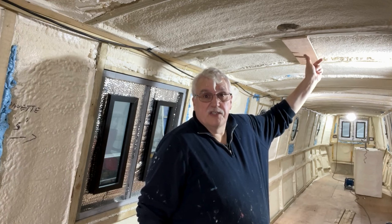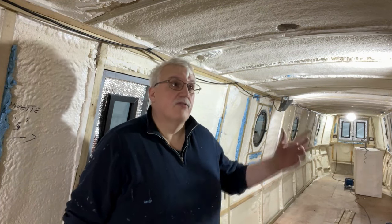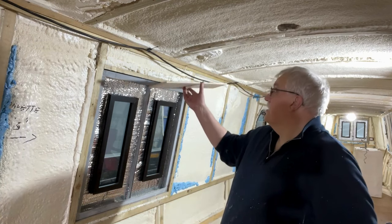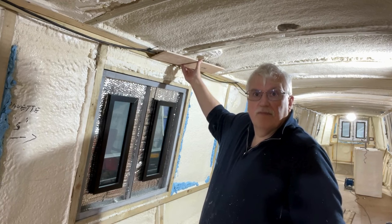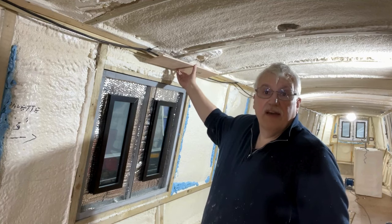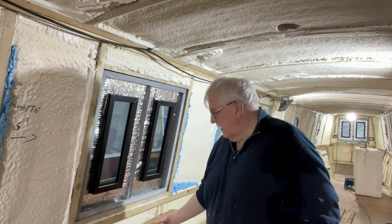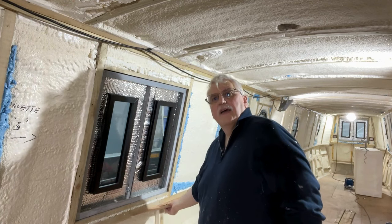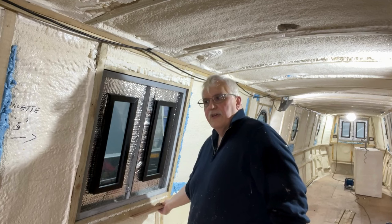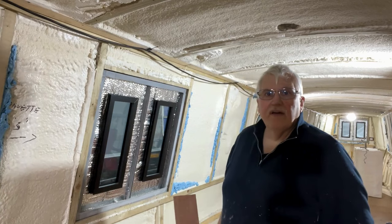That's got some advantages in terms of fitting the rest of the wood, because the sheet supply will fit quite nicely on there, four foot wide. Some people put the cable trays up here, but that's going to take quite a lot of space and we've got other ideas for the ceiling, so we don't want to do that. Our plan is to put the cable tray under the gunwales, port and starboard side, and I'm just going to start measuring up for how that's all going to fit.